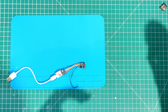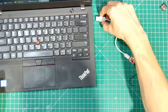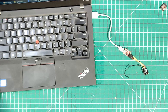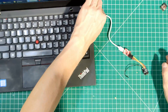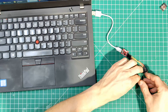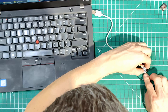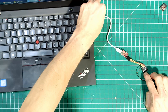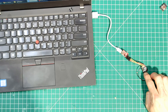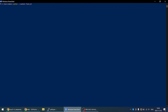Let's get this over to the laptop and see if she blows up. I'm going to plug it in. So far, so good. Let's reset this — unplug it, I'm going to tie IO9 to ground. Just my finger. Plug it back in. A push button would be a great addition for that, wouldn't it? I can't even fit one on top there. That should be booted. Let's see what Flasher ID thinks — COM4, ESP32C3. It's working as expected.